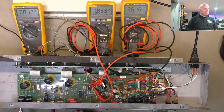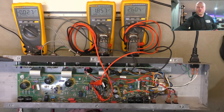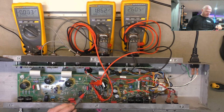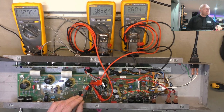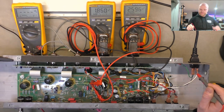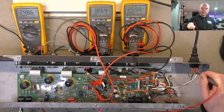So we were aiming for 2 volts for 50% on this side, and then 2.8 volts on this side. So that's given an anode to cathode voltage of 415 volts. So what is it? 430. So we're higher on the unregulated mains because we are sitting today at 248 volts. Doesn't look like 220 to me, does it?